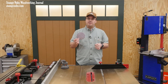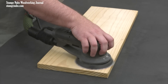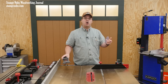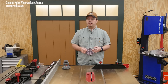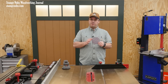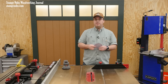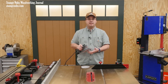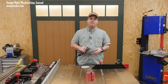You have to keep your sandpaper clean during use, and this is usually best done by attaching a shop vacuum to your sander. Lacking that option, you may have to pause from time to time and blow the caked dust out of the grit with some compressed air. Keep in mind that resinous wood like pine can be more difficult to clean up because it can gum up your sandpaper. Sometimes you can run the sander over a rubber stick — which is made for the purpose of cleaning sanding grit — or even an old shoe sole, and that can give your paper a new life.